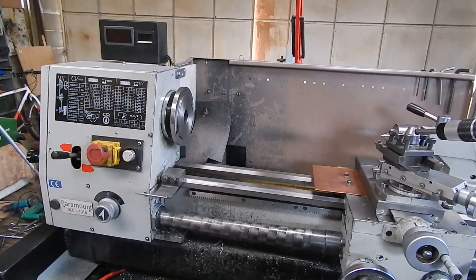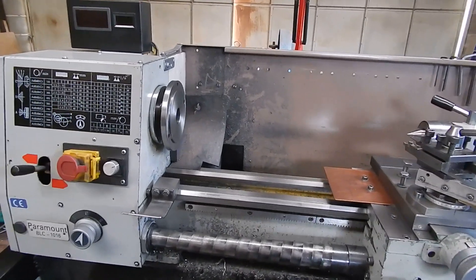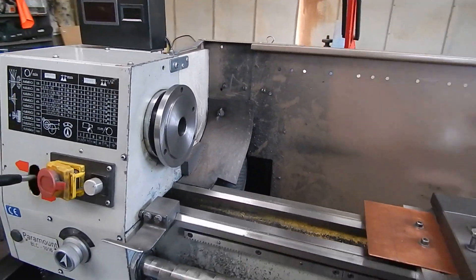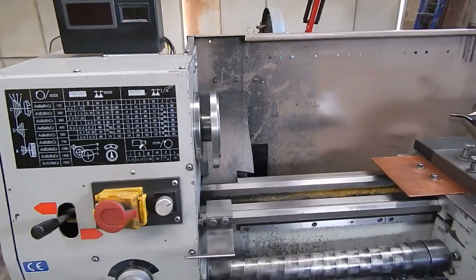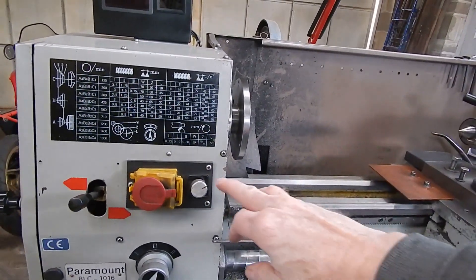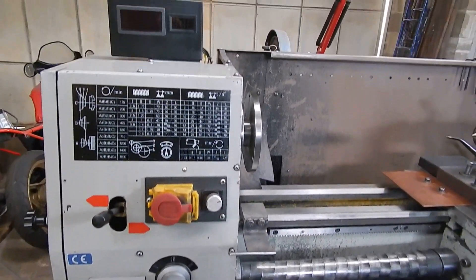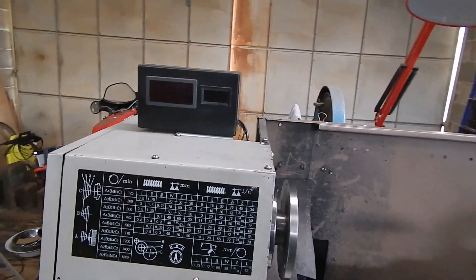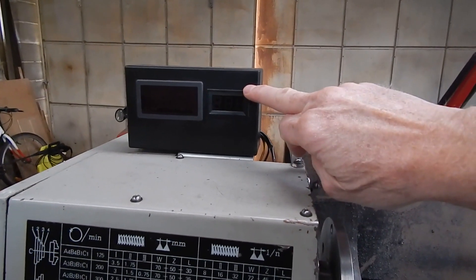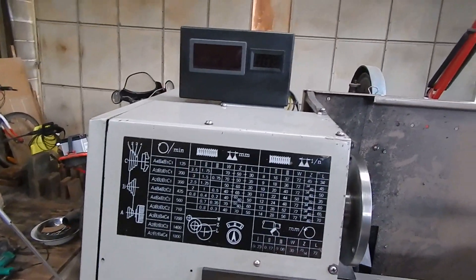This time around I've got a heavy-duty DC motor out of another treadmill and I'm going to put it back on. At the moment the lathe is in AC mode and the electrics are sort of jury-rigged on it to keep it going. You can see on the control panel the trim pot for the DC speed control that's still on there, and up the top, in addition to the tachometer, we've also got a temperature gauge so I can monitor the motor.